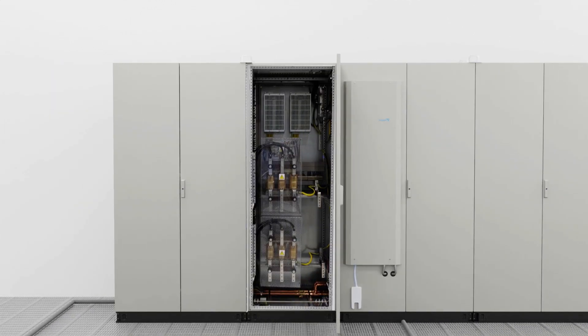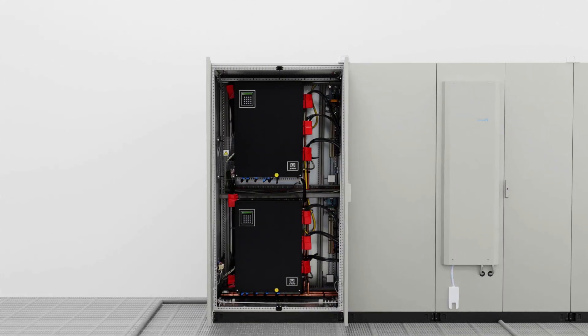Running the system on a 1250-volt DC bus can present challenges to some motor insulation. We have the option to include a dv/dt filter and snubber circuit where required. The final cabinet accommodates two of our dyno drives.